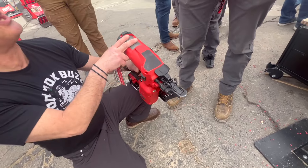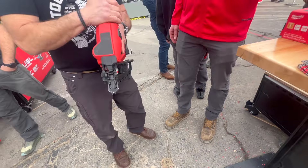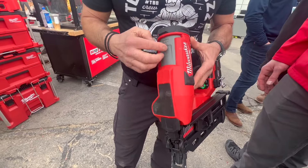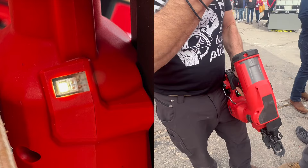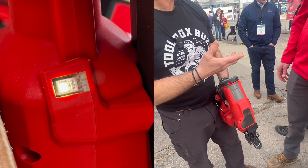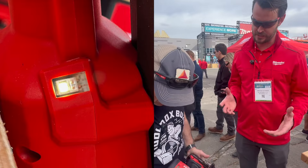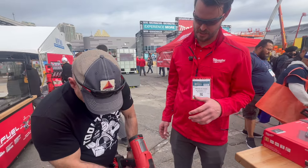And this looks like a nitrogen tank? Yes, that's our nitrogen gas spring mechanism, similar to our other nailers. We covered this in a lot of our tool reviews on Milwaukee nailers — how they use nitrogen inside the tank, which means less corrosion and it's less permeable. It's more consistent than an oxygen mixture, so you're going to have that consistent seating performance at pressure.